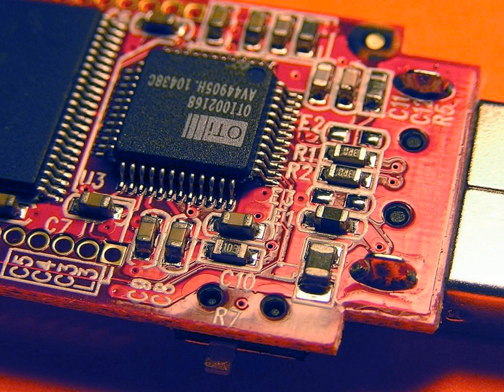Finally, the boards are visually inspected for missing or misaligned components and solder bridging. If needed, they are sent to a rework station where a human operator repairs any errors. They are then usually sent to the testing stations, in-circuit testing and/or functional testing, to verify that they operate correctly. Automated optical inspection (AOI) systems are commonly used in PCB manufacturing. This technology has proven highly efficient for process improvements and quality achievements.